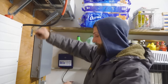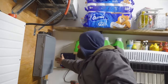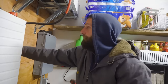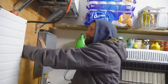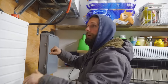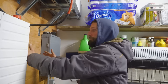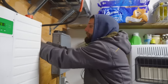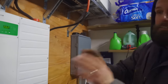You're probably wondering why I routed through there instead of coming right through here and coming down around that panel. The trough stops before the panel stops, so in this area right here we have extra footage. We can swing this stuff around if need be in the future if we're planning on putting a second inverter right here. I don't want to put hard pipe there because if we go that route in the future I'd be tearing it out and doing it again. These are a little bit longer - we can unscrew these and move them further over to the right if need be, or come around the backside and make something else work.